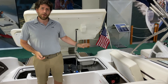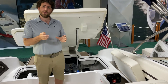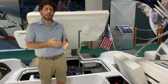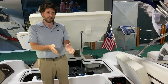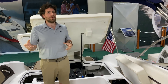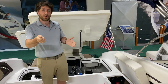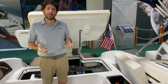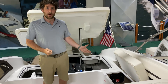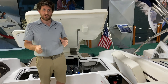You should never run your boat for an extended period of time in the combined position. That should only be used to initially start your boat if the batteries are dead and to juice up the batteries for 20 minutes. The reason you do this is it gives that completely dead battery just enough juice so that the system will detect it and recharge it when the switch is returned to the on position. A completely dead battery cannot be detected by the ACR system, which is why it's necessary to run the boat in the combined position for about 20 minutes before you return it to on.